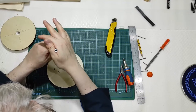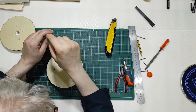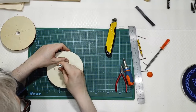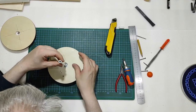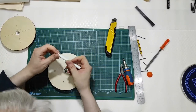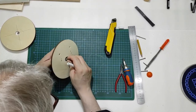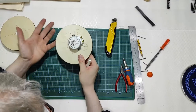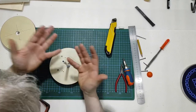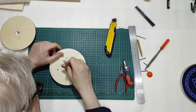This is 10 millimeters, 1 centimeter PVC pipe with a 1.3 millimeter thickness that fits perfectly, almost perfectly, on this rod, this shaft here. The problem is I needed to glue it, but I don't want to lose the ability to reuse once again this motor after having dismantled my village. Epoxy glue, yes, but then the motor is kaput, more dead. Okay,